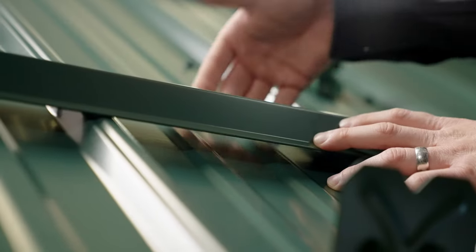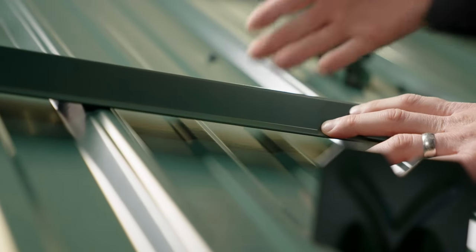When the metal moves through expansion and contraction, the fasteners can work loose, breaking the seal around the penetration. And the low profile means it's easier for leaves and debris to get trapped against the rat guard, which traps moisture and can lead to staining and eventually paint failure.